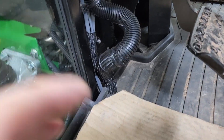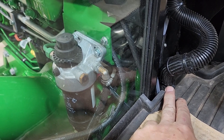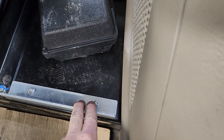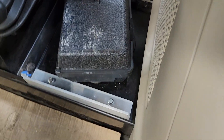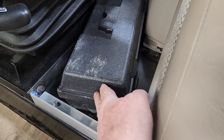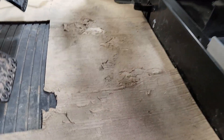There were some wires in this corner that were not in loom — cleaned those up. Then I put a bracket, an aluminum angle, right here. Put some nutserts in here, some stainless bolts. That way whatever you put up on this little ledge here isn't falling down on your feet and causing a safety hazard as you're going down the road.